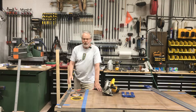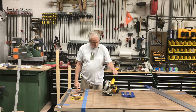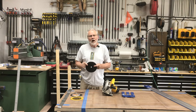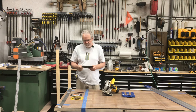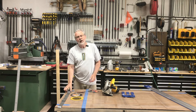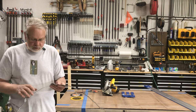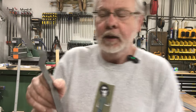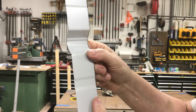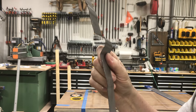We're getting ready to cut the metal for our catio project. For cutting, I just use a normal circular saw. You can use an abrasive blade, but the problem is that it's great for cutting angle irons and things like that — when you get into this thin metal, it just literally tears it up. See the burr on that side and the burr on this side? Very, very ragged in regards to the cut. So I don't like using an abrasive blade on this thin metal.